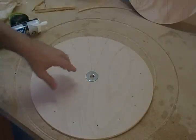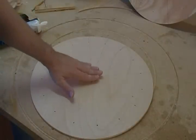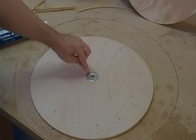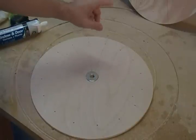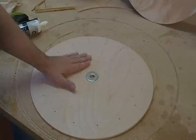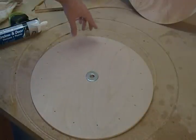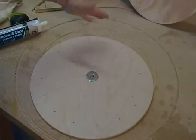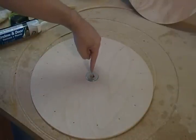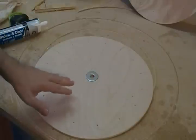So go ahead and glue your washer on top of your rotor. Do that for both pieces — you have a 5/8ths washer, and then your 3/8ths on the other rotor. That way we have those set and ready to go. Once we put the fins in and build the rotor, it just gets really tricky to put that in there and center it up. So we're going to do that right now, and I'll see you in the next segment.